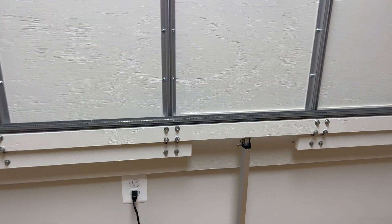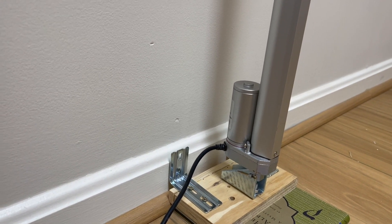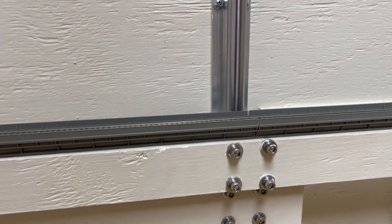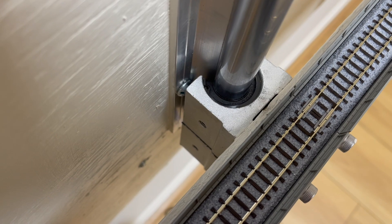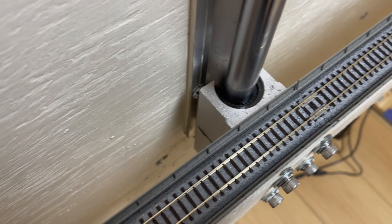Let's take a look at the components. I ordered from China a gadget called an actuator arm — that's what's doing the lifting. That's the motor that drives gears that force the arm up to raise the elevator. Here's the track. The other components from China are these rails upon which glide bearing blocks. I followed the design of a modeler who lives in Manchester, England, with design adjustments to accommodate my situation.